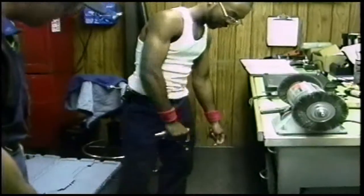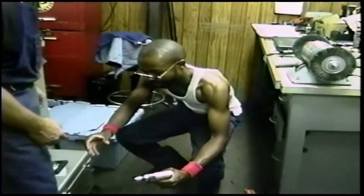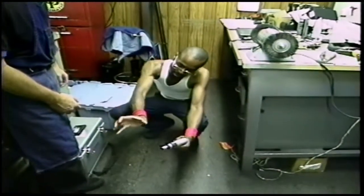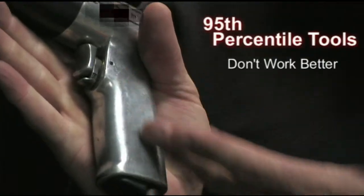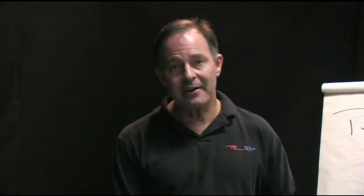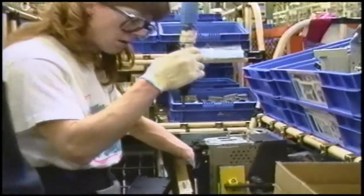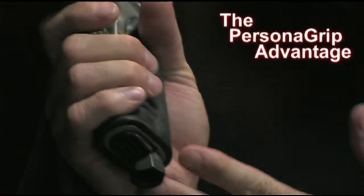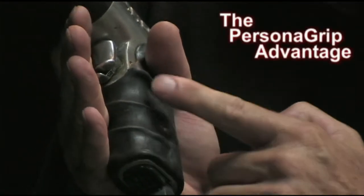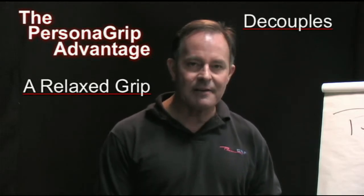Persona Grip has the luxury of going into your workplace environment and observing the tool being used at a particular workstation. Now, if the worker is using a 95th percentile tool — meaning that for 95% of people who hold it, they won't find it objectionable, thereby increasing sales for the manufacturer — if they were to relax their grip, the tool would probably slip out of hand and cause further injury. On the other hand, if I can go in there and observe the motions and the actions that the tool is being used, and build up wings, flutes, and flanges that would otherwise resist the movement that would occur when they were to relax their grip, I have thereby decoupled the user from the tool and mitigated the effects of vibration.